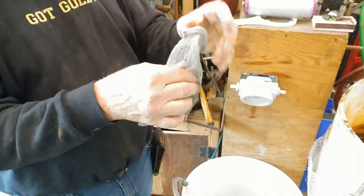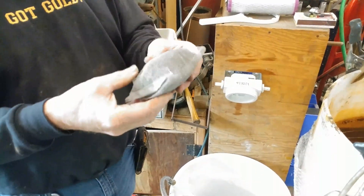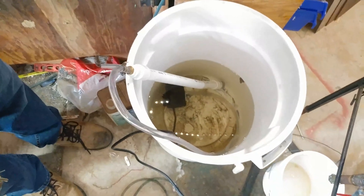So you will want to rinse your carbon before you use it. It will continue to shed even after it gets wet after you have rinsed it. Look in the bottom of the barrel — you can see that it has been shedding. And you don't want that to go to your settling pond, your tails pond.